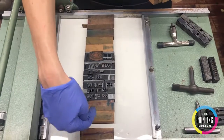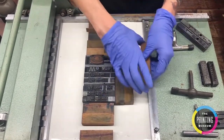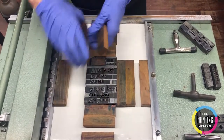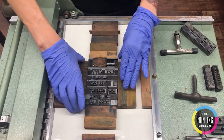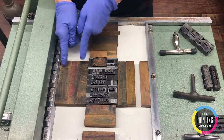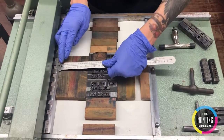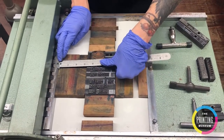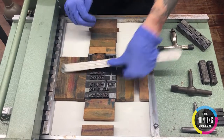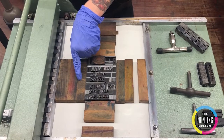I'm filling in my space top to bottom, now I need to fill in my space to apply pressure left to right. These are different widths — it's kind of like filling in a jigsaw puzzle. You choose the widths based on the overall space that you have and you can do some measurements. For example, the space I need to fill in is about 20 picas, so if I add up the widths of each of these they should add up to about 20 picas.